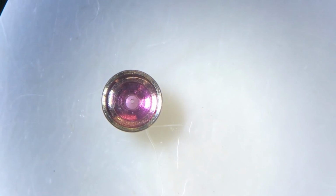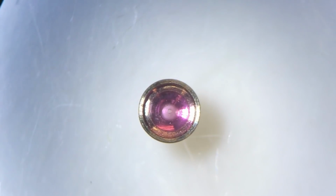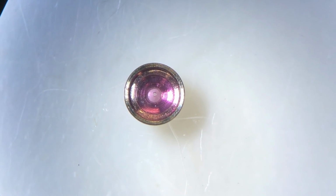It wasn't ideal the way I dropped it on. You want to try and get it dead center when you're putting it on, because that keeps the oil in one place, but I was trying to do that on camera with my naked eye, looking at my phone screen rather than through the eyepiece, to try and keep it in focus for you. So that's my excuse, at least. Hopefully you understand now how to oil these particular jewels. I'm now going to put this particular one into the main plate. I'll show you how I put the little spring back on it, and then the other jewel I'll do separately and put on the balance, and I'll do that off camera because it's pointless showing you it twice.